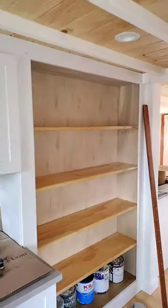The customer wanted a pantry cabinet, but they don't make one for this width or height, so I started by building a box out of poplar with a nice half-inch oak back. I kept the base the same height as the kitchen baseboard, kept the top rail carried around the same as the rest of the house, kept the depth the same as the cabinets. I used a piece of scrap to make a jig so I could have adjustable shelves.